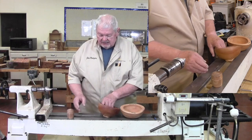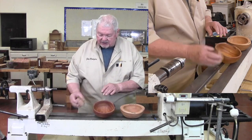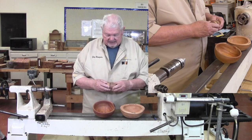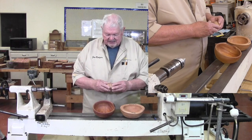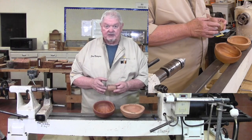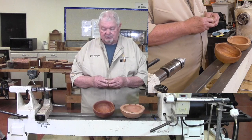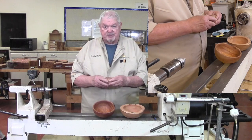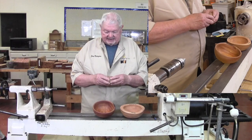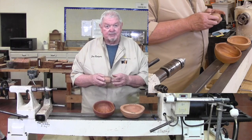The third classic jam chuck is the one that's done when you're turning a box. Because in box making, you have a minimum of 2 jam chucks that have to be fitted perfectly and then loosened up later. For instance, the lid on this box right now is, for real practical use, just a little bit tight. So we'll talk about jam chucking here.